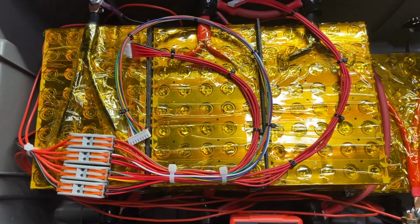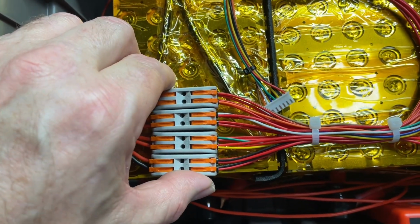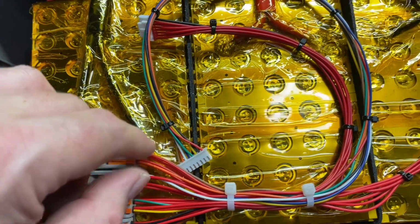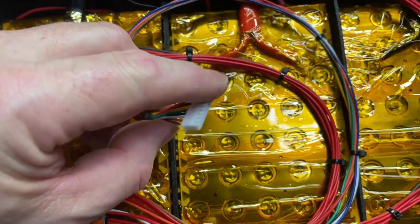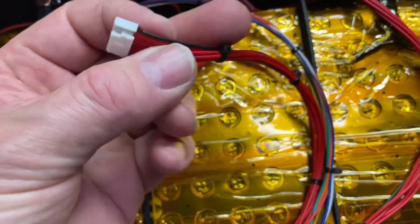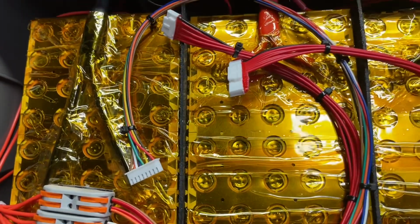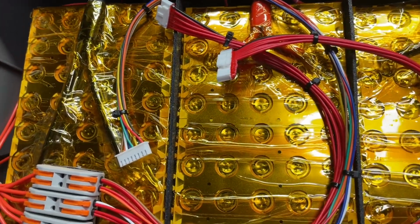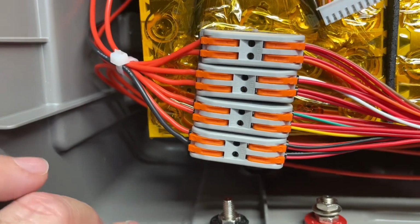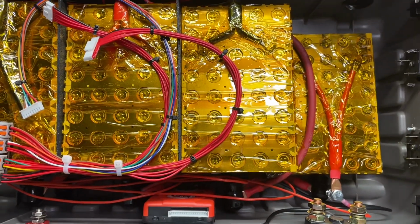Okay, I've finished wiring all the balance leads through the terminal that I made with the 4 clips. I did check to make sure that the voltage increases prior to doing this, and on each and every one of these I also checked, putting in the negative terminal and then increasing the voltage, just to confirm that they all do this, because as I said, if we plug this into any of our devices and we have this wired incorrectly, we will destroy that device. So at this point, I'm going to mount the balance leads down on the side of the cable, and then we'll start connecting our devices and wiring everything together. So let me go ahead and take care of that.